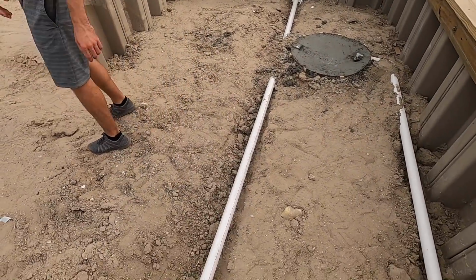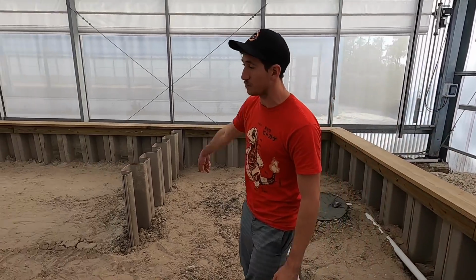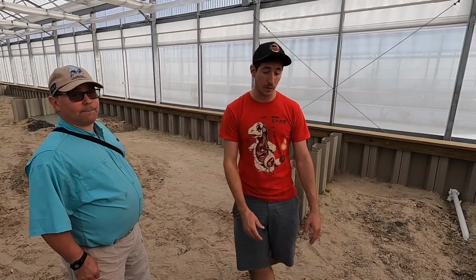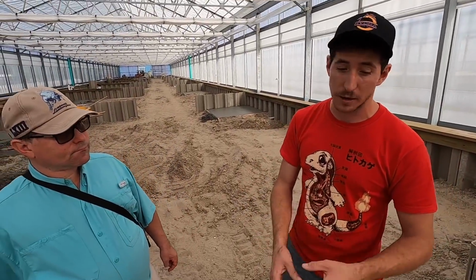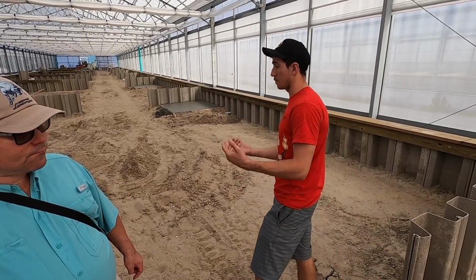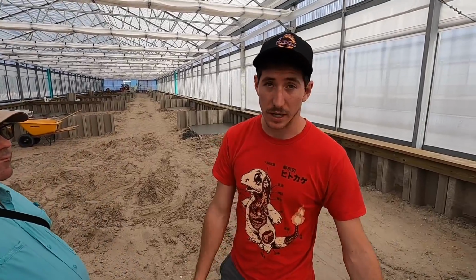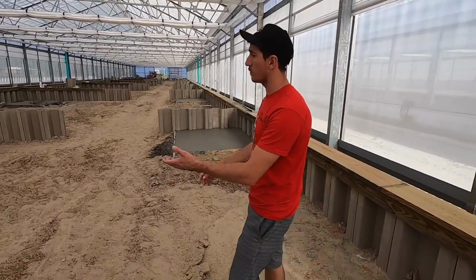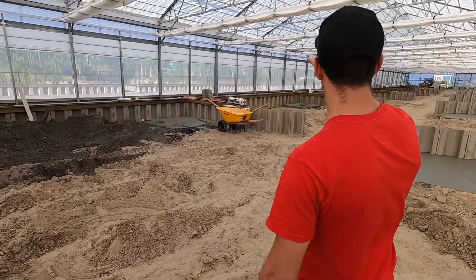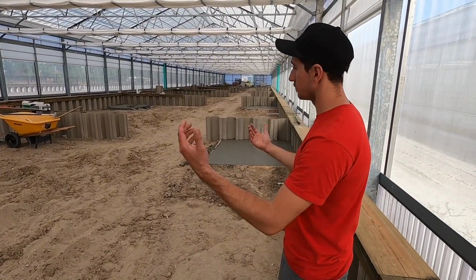So and you got pretty big pipes running through here. You're gonna be flowing a lot of water, huh? Yeah, when I said 2-inch, they thought 2 inches everywhere because I meant 2-inch main. So I meant 2-inch main, well, they ran 2 inches everywhere. Well, again, it's kind of like the ponds where it's better to be deeper, it's better to be bigger pipe than smaller pipe and not be able to have the water flow that you need, because all of this, you set it in concrete, and then what do you do if it's not flowing enough? So, and also the beauty of it too is, like I said, if that one is super dirty and the others are clean, I can turn the valve and really flush that out super quick, and then be on my way.